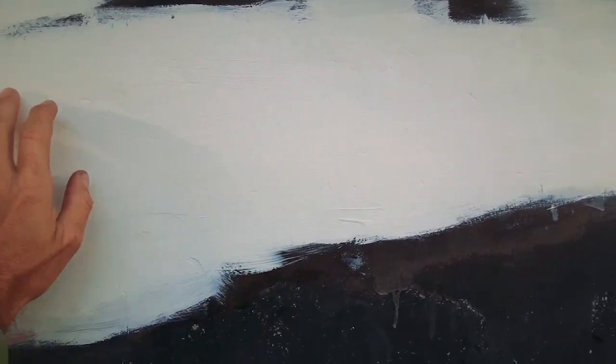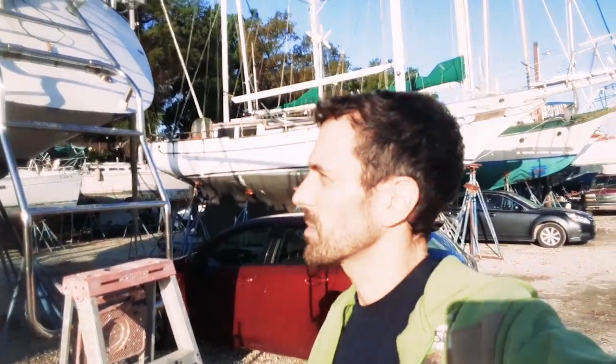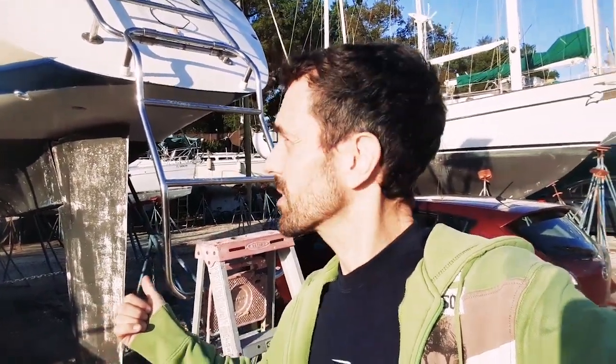You can see here I used the same product on the keel. Sorry, it's a bit low lighting — the sun just hasn't come around this far yet. But here's a few coats of that two-part epoxy barrier coat on the keel joint — it is looking fantastic, very solid, ready for bottom paint. My next step today is going to be sand and prep the hull for antifoul. I'm going to paint the pinstripe back on, the one I'm keeping. I opened my locker yesterday and found about half a can of the paint I used last time, so hopefully that's enough to finish the job.